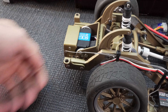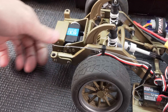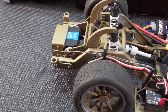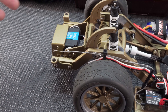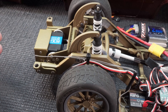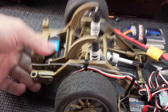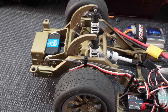If we look at the specifications for this servo, we can see at five to six volts we're only getting 29 to 32 kilograms of torque. I went in with a meter and checked to see exactly how much voltage is coming out of this receiver — it's only at about five and a half volts, so I figure we're probably getting about 30 kilograms of torque. If we can bump up the voltage to 7.4 volts we can get the full 35 kilograms of torque, and that's where a BEC comes in. A BEC will allow us to take direct battery voltage — in this case an 11.1-volt 3-cell LiPo — and output however many volts we want directly to the servo. The servo will still get signal from the receiver but it'll get power directly from the battery. I'll set the BEC to 7.4 volts so we don't overload the servo, and it should give us enough power so it can lift and stay up without sagging back down.